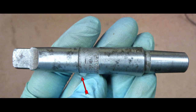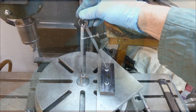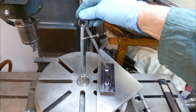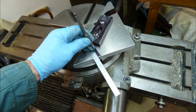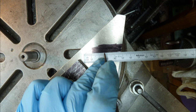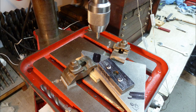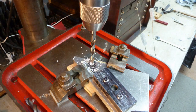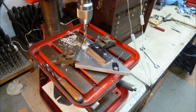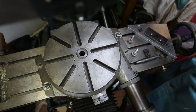I have a shaft with a number two Morse taper which is placed in the Morse taper in the centre of the rotary table. The top face of that shaft has a centre hole drilled in it. I set the dividers as close as I can to 67.79mm — the distance from the centre of the rotary table to the centre of the two securing bolts — and move the fixture plate around until both bolt centres are 67.79mm from the centre of the rotary table. With the fixture plate in the correct position, I estimate where its two securing holes need to be drilled and mark their positions. I place the centre in the chuck of the bench drill, bring it down to the centre punch mark, clamp the plate on a small sheet of MDF, drill a 3.5mm pilot hole, then drill the 12mm clearance hole. I do the same for the second securing hole.